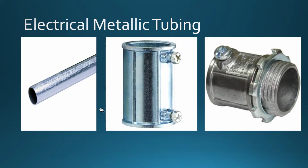Sometimes you'll be asked to mount the security cameras using the EMT and some of the couplers. So what happens is you mount that thing somewhere in the red iron ceiling. It's those triangular construction contraptions that are in the ceiling, popularly called red iron. You all know what I mean. And sometimes you'll be mounting this onto the red iron using whatever means you can safely accomplish.